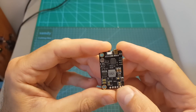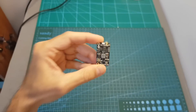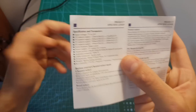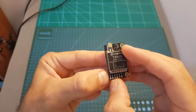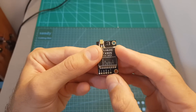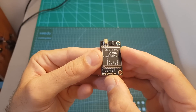Configuring the VTX output power and frequency can be done using the button on the unit, and the LEDs will indicate the frequency and output strength — just refer to the user manual. Of course, the preferred way is to use the Smart Audio pad. Connect it to a free UART TX port on your flight controller, then under Betaflight configure this port to use TBS Smart Audio protocol, and after that you'll be able to configure the VTX using Betaflight's OSD.